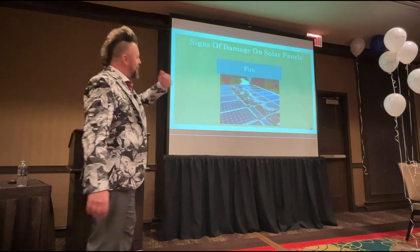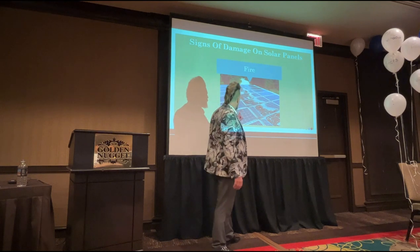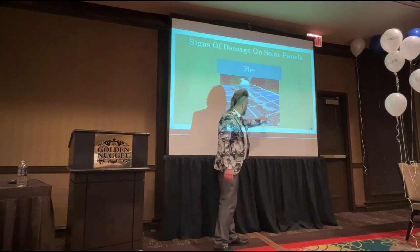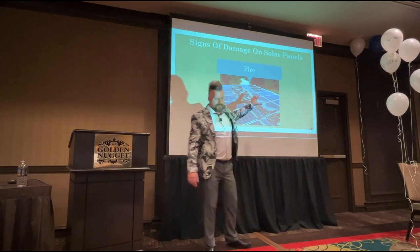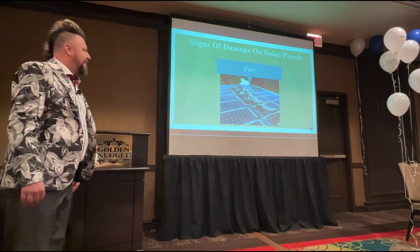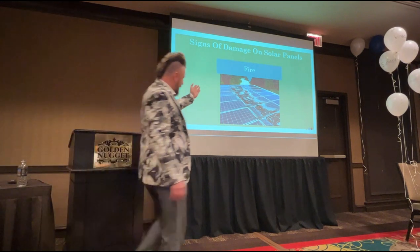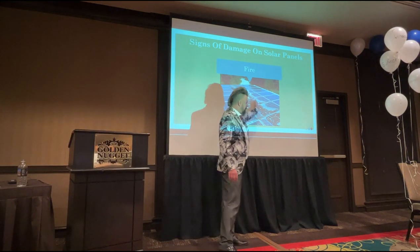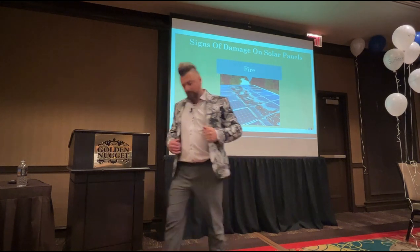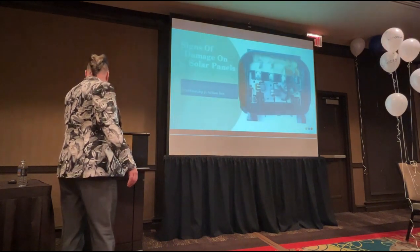So that's the aftermath of a fire. This is a very easy sort of fire for me to diagnose. I know what's gone on here: the cabling has overheated to a tremendous degree, and that fire is self-contained and itself extinguished. That's a cable-based fire, okay? That's not due to soiling, that's purely a cable-based fire because it's knocked out that single string of panels. Turned off because the water was in the tray. Yeah, probably because of an MC4 resting in the tray.